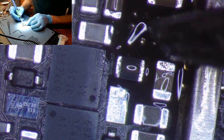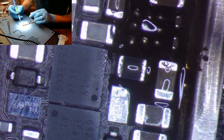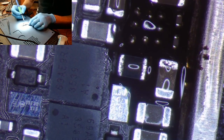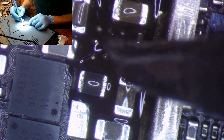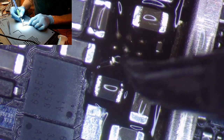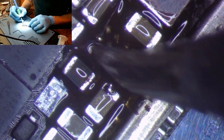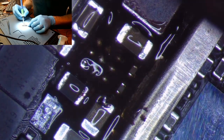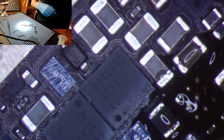All right guys, I think that's good. I don't want any Hershey Kiss type things sticking up. And then maybe add some solder to my tip here. Maybe that will help us a little bit. There we go. That's getting there. There, I think those are all fluffy pillows. Now, except for this here, which looks like trash, we'll go ahead and clean the flux off the board and see what it looks like.